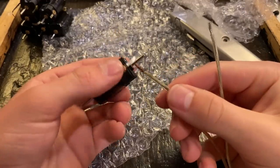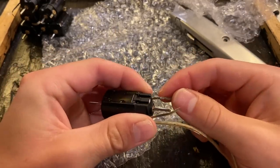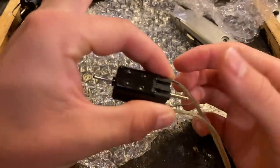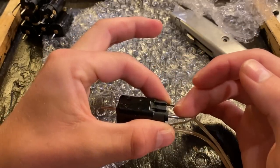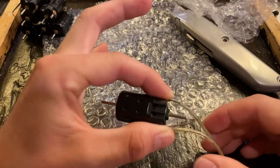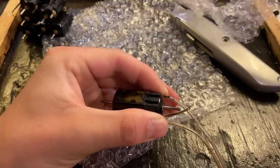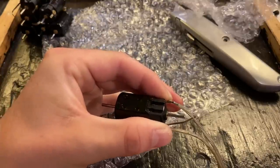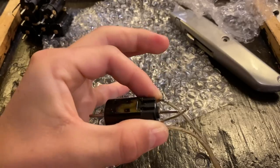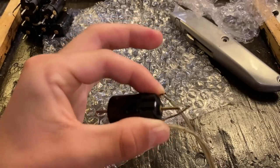I've got some leads from a 16 volt Tyco controller at about 30% power, and you can see that thing is doing just a fine RPM — it's not bad torque wise either. Let's see if I can get it down to a little bit of a lower speed; it really doesn't take much power. Unfortunately this Tyco controller can't actually do a low enough speed, but overall it seems to be a fine runner.